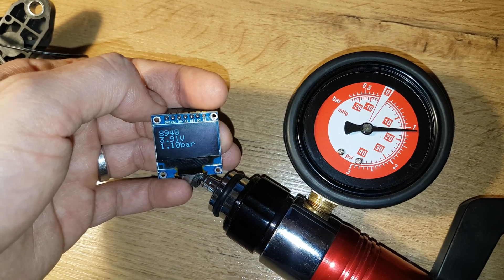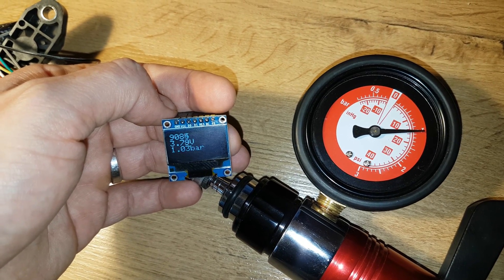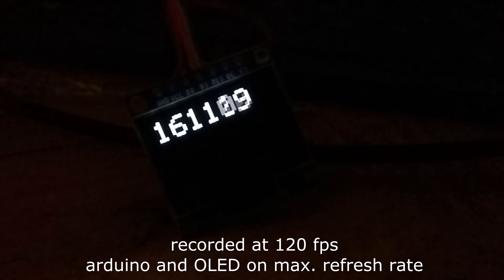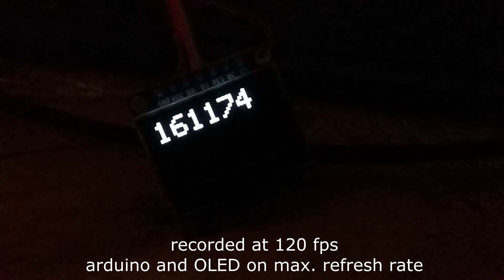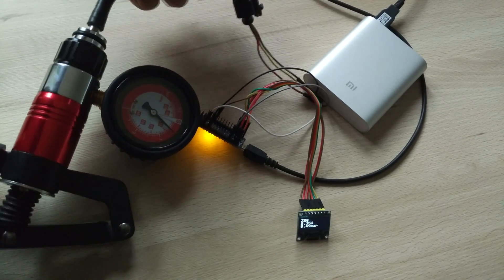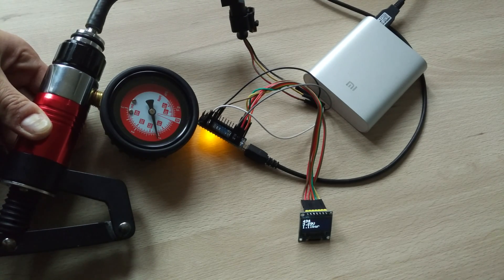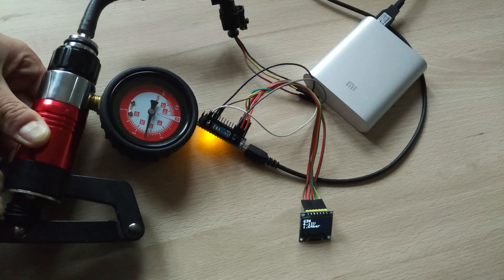You may notice blinking as the OLED refreshes itself — this effect is not visible with the naked eye. I recorded some 120 frames per second footage of the OLED refreshing; it displays all the digits human eye cannot see. LCD display is much slower as it takes more time to change crystal state than it takes to turn an LED on and off. This is still a work in progress, so I will publish the source code with part 2 of this video. I am designing a case which I will 3D print and install in my car. Don't forget to subscribe and watch it installed. Thanks for watching.